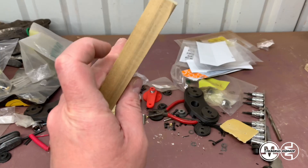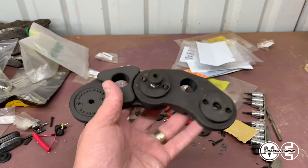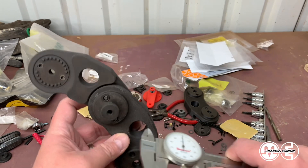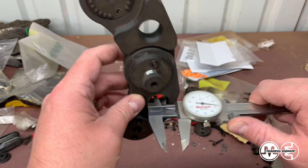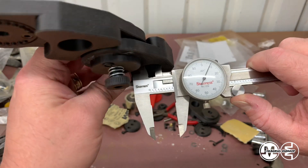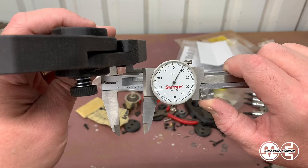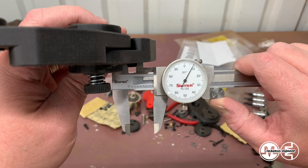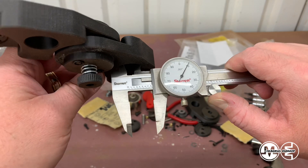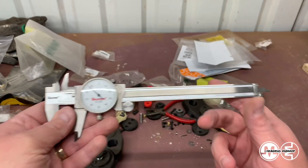So really, honestly, the wood is actually pretty close — closer than I would have thought. So if you wanted to measure a hole, let's say you have a piece like this — this is a component from my phone boom. I think I made this a three-quarter inch hole, but I don't remember. If you want to measure the hole size, that would be definitely not 0.75 — that would be 0.808. And typically you'll want to move these around a little bit inside the hole just so it settles to a number you feel comfortable with. Now I'm getting 0.809.